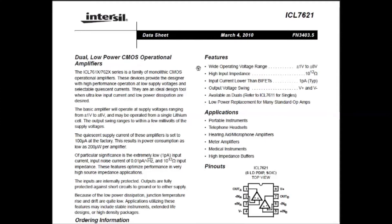I've also used this op-amp with two double-A batteries with a plus and minus supply — it will run as low as plus or minus 1.5 volts. So it's a very handy little op-amp. If you have a project, you might want to consider the ICL7621 op-amp.